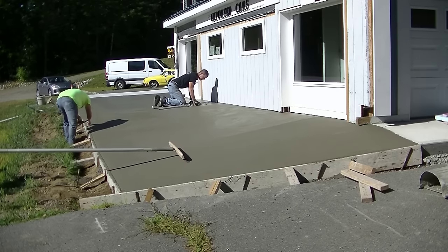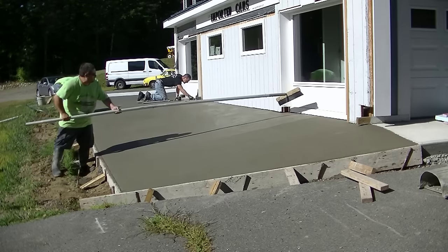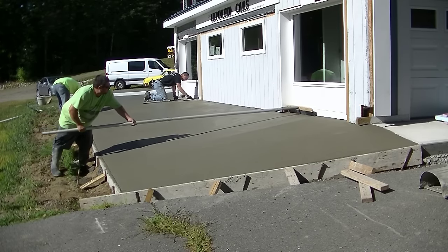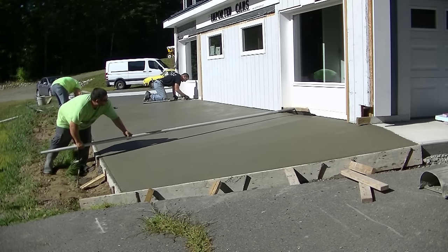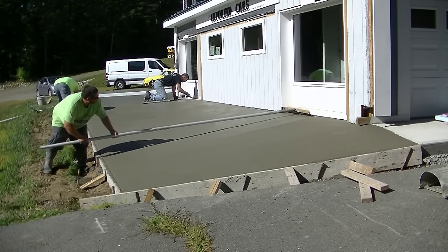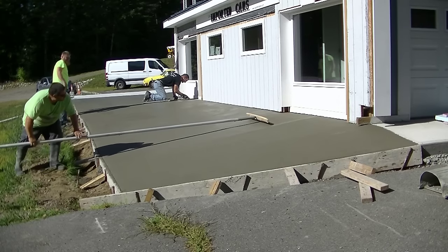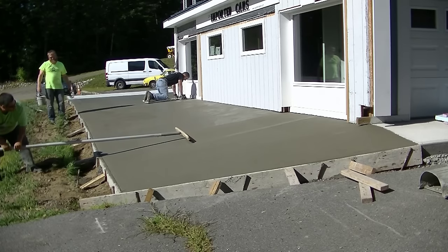But you can see how we finished it, you know, with just a broom finish pulling it downhill. I'm doing the mag floating, Darren's doing the edging, and Eric's doing all the brooming. And that's how we pour a steep slope and finish a steep slope with concrete. It's a little bit more work than normal. It takes a little bit of skill, but if you've got something really steep that you want to put concrete over,